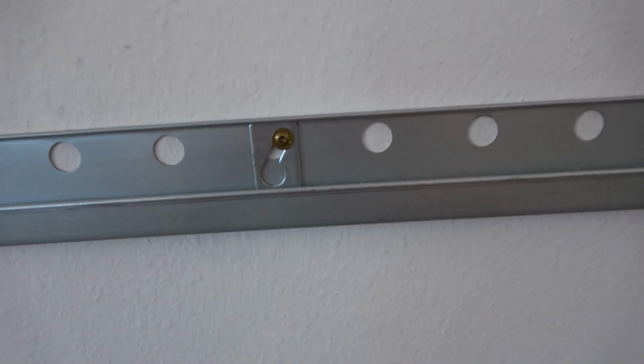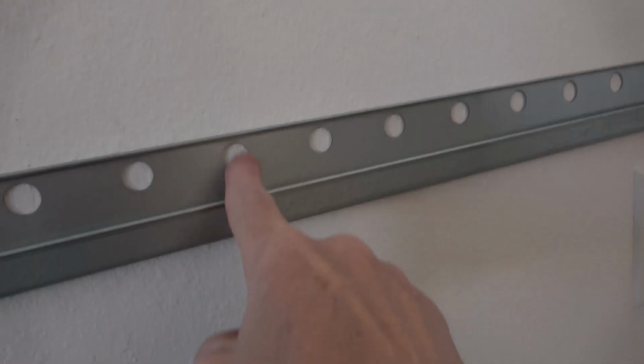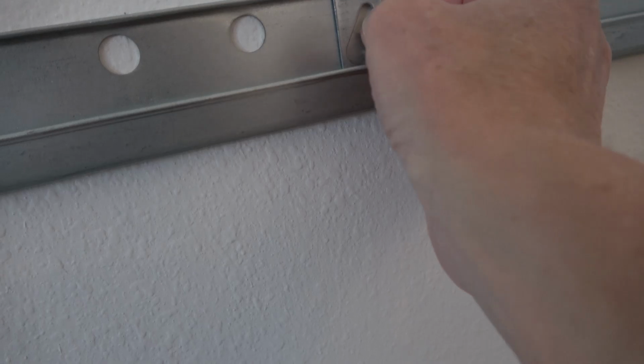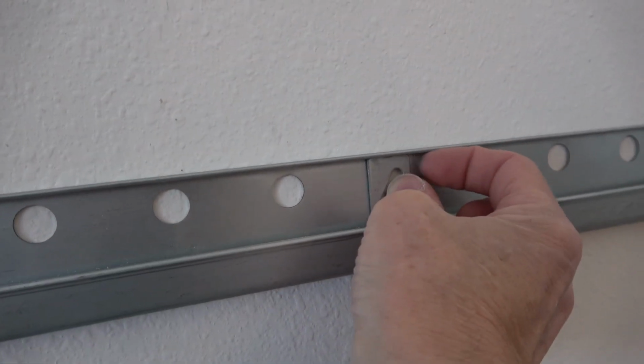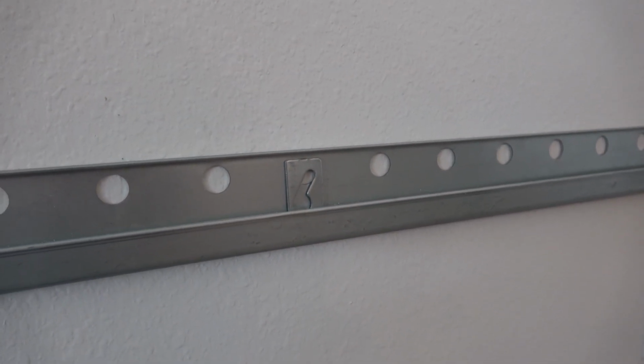You can kind of see how it works, right? So I have this right in the center of this longer one here, 7 foot, this one is, and that's what they come in, 7 foot, so just FYI. And then I'm going to do another one here, so you can see I have a stud right here, and this one actually lines up perfectly. So again, you're putting them in like this, and then this will be against the top edge right here, and then the cabinet screw just goes right into that stud right there. So basically I've got a stud here, here, here. There is one here, but that's right next to the electrical wiring right here. So I may skip that one. It's really not necessary because I got one here.